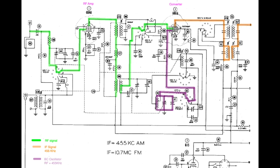But the inductance of the coil in Henrys and the combined capacitance of these two, both the main tuning cap, oscillator cap, and its trimmer, are combined so that this LC circuit oscillates at the RF frequency plus 455 kilohertz. We see another one right here where we've got RF being amplified through the RF amplifier, comes down through